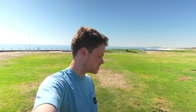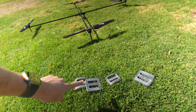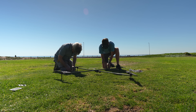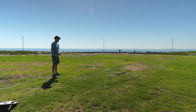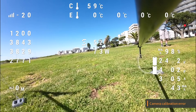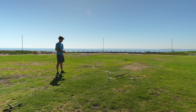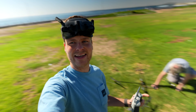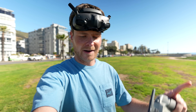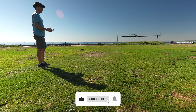I brought the drone down to the Seapoint Promenade to test fly it and get the tune right. I've got tethers with lead weights to tie the drone down on each corner, just to stop anything catastrophic from happening if it tries to flip over. The drone started out super rough and immediately got into a pretty uncontrolled oscillation, so I'm really glad we had the tethers on. I tried again with slightly lower gains and longer tethers.